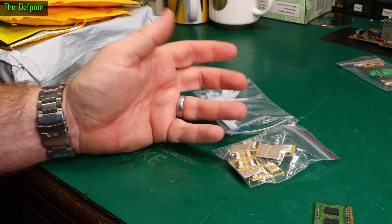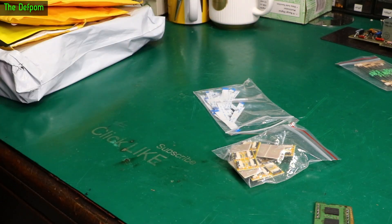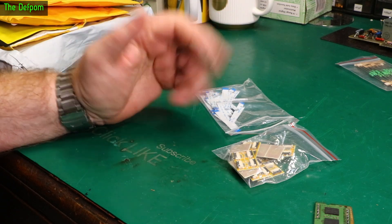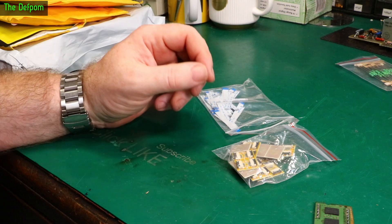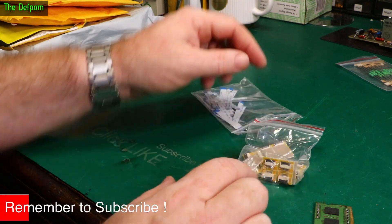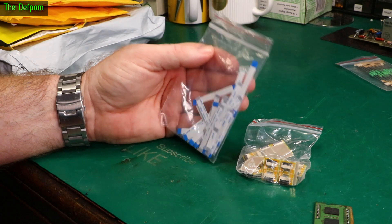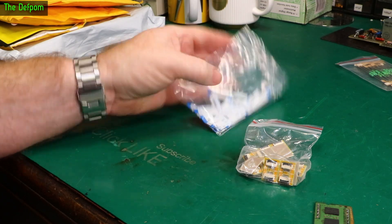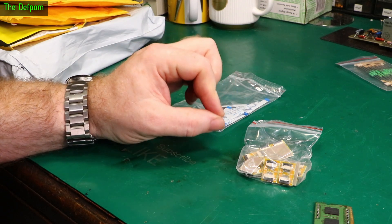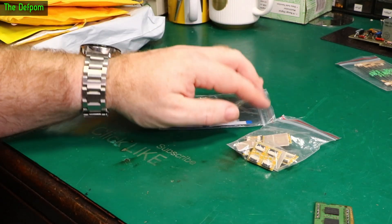Part of the problem is that I would like to do it a different way - I'd actually like to do a hard ribbon cable, because right now I'm manually wiring from that adapter onto the microcontroller board. It's very manual, but it's only a very niche product - only half a dozen units, so it's not worth redeveloping. I was thinking about getting some of these little extender boards so you can plug the ribbon cable straight in from the memory display and use little extension ribbons to run over to the main board. There is a gap between the display and the main module, so the original flex wouldn't reach - that's why I've got these as an extension, in case I ever revisit it.